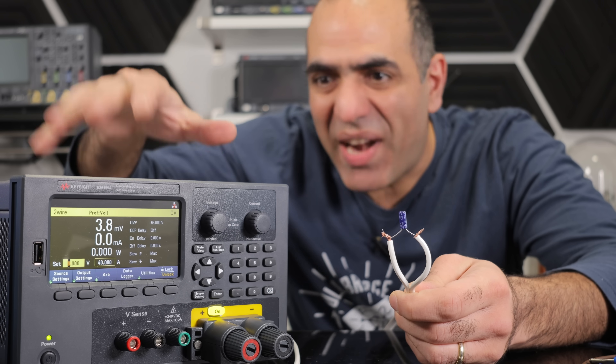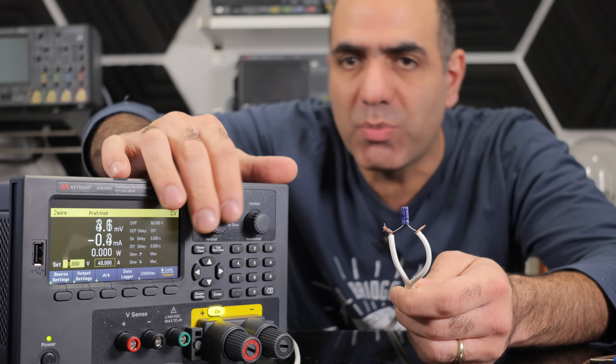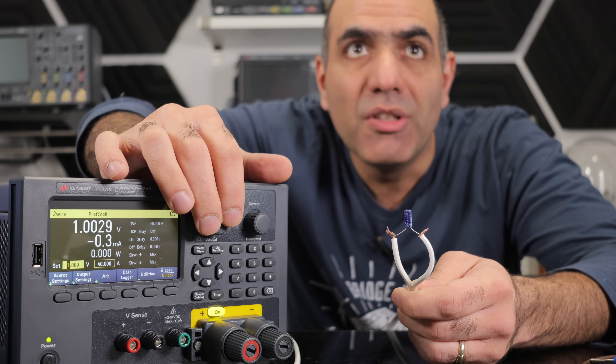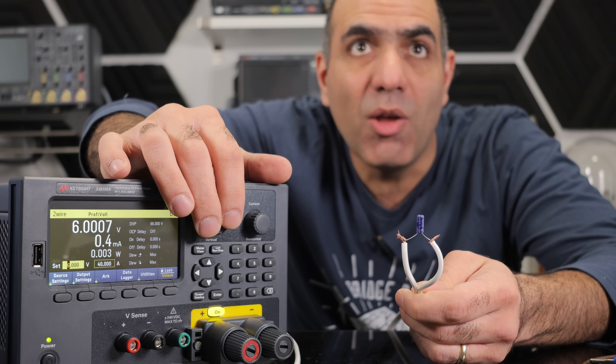I have a brand new 60 volt 40 amp power supply, and my capacitor is rated for 16 volts, but I place it in reverse polarity. If I increase the voltage, at some point it starts conducting current and the capacitor will slowly heat up.